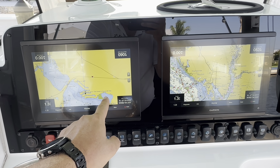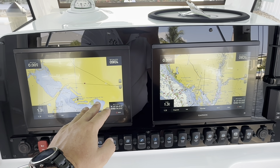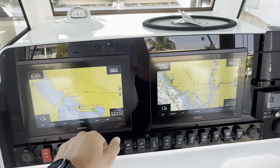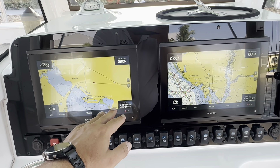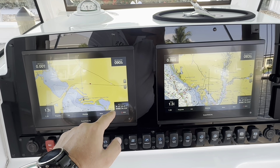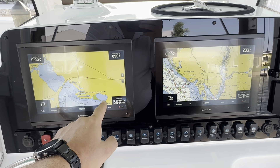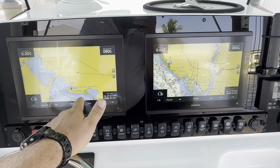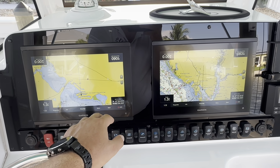I've already put the memory card - a 32 gig blank SD card - in. Just get one from the drugstore or wherever. These Garmins have not been registered to anybody before. If you just bought a used boat and the Garmin has another Active Captain email address or user already in it, you need to go into Menu, then Settings, and do a reset to default settings. You also need to call Garmin to remove the old user's email address from the serial numbers for the units.